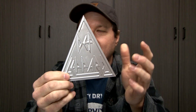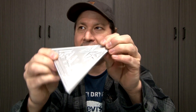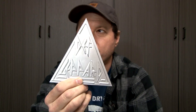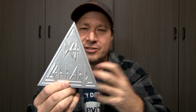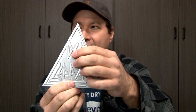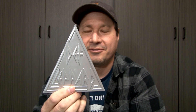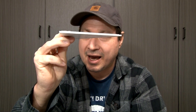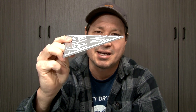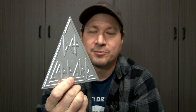Those aren't very friendly for casting — it's like a sand magnet where sand just wants to go in and say, I found my home and never come out. One of the ways I thought I would try and move this forward is I put the primer on a little thick. That's why you have a little bit of rounded edges — not perfectly flat letters — hoping to round the edges out next to the letters so the sand won't stick as much. And then everything has sharp edges, which is not great for sand casting. And to top it off, I decided to make it really thin.